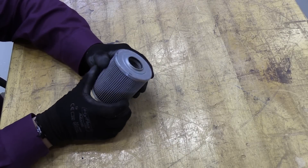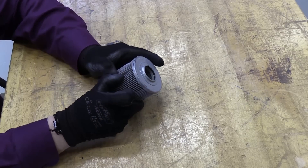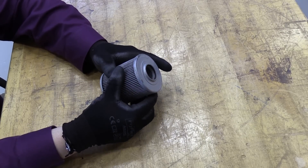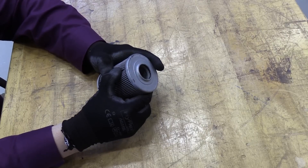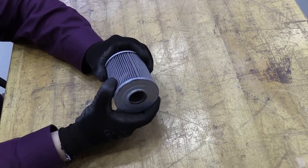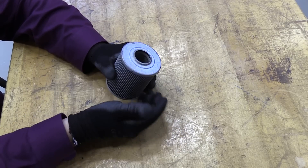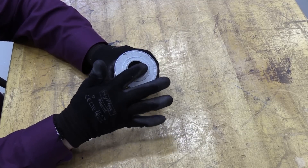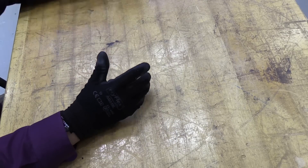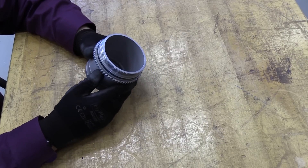So once we remove the filter, as required by the aircraft maintenance manual, we're going to want to do a complete inspection of the oil filter, examining between all the pleats for any type of material that may cause a problem. This is typically removed and replaced. As it is replaced, always validate that any packing material — in this case an O-ring — is installed before reinstallation into the motor.